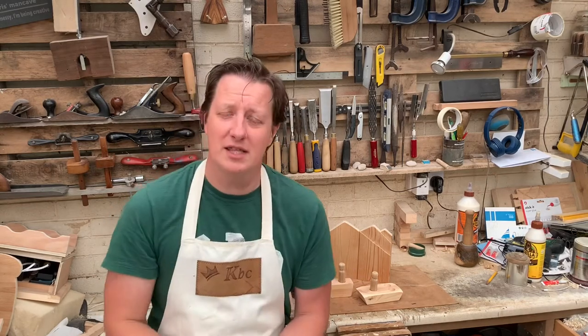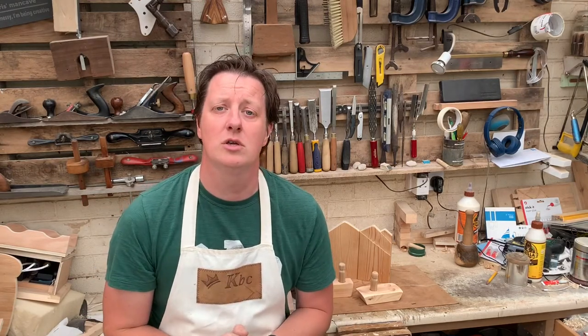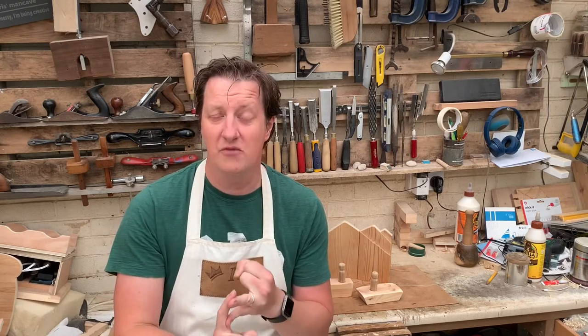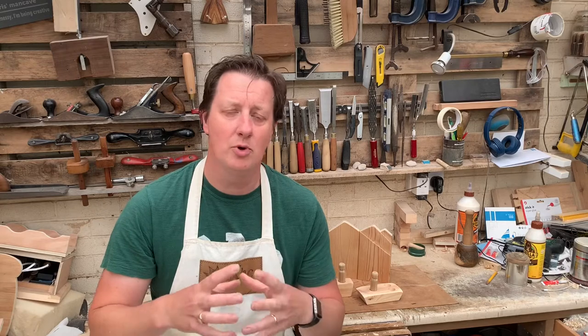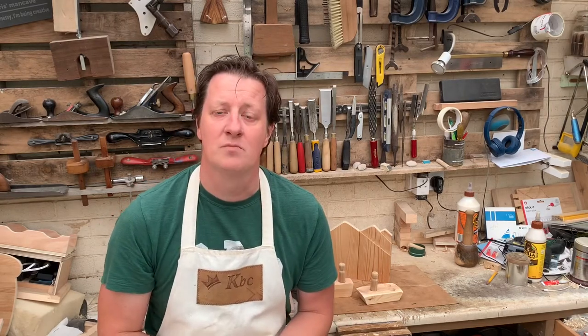Now then, a few safety points with making child's toys. Big stuff like this, we're okay for choking hazards because it's big and chunky. We do need to make sure, though, that we're not using pre-treated woods. So we don't want to be using any old spare decking timbers or pressure treated fence posts. We don't want to use any pallet wood because they've got fungicides in them. Those nasty kind of stuff. So we want plain, simple, untreated wood. Scrap ends of pine is absolutely perfect for this. And then we can come through and we can make off these sections and then feed the imagination of the kid that's going to play with them afterwards. Okay, right, let's tuck in and see how we do it.